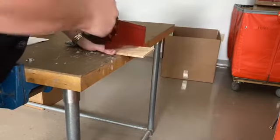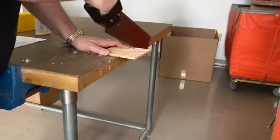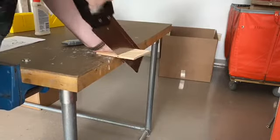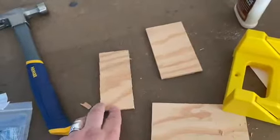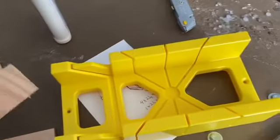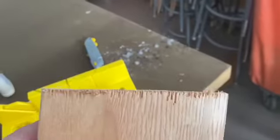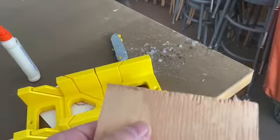First you want to just make a channel so you can start cutting. Be careful about where your hands are when you do this. If you have clamps in your house that you can use, use them for sure, but you don't need them — you can definitely do it by hand if you do not have clamps; it's just a bit more work. So once that first cut is done, I've got our piece here that's at two and a quarter by about five. Then the pieces are small enough that they can fit in the miter box, which makes it a little easier. One thing you're going to notice when you start using the miter box or the saw in general is that the back of your cuts are going to get rough from using a handsaw. This is going to add a little bit of challenge when you're fitting your pieces — you're going to have to worry about that edge and you're going to need to sand. We'll be talking about sandpaper a little later.